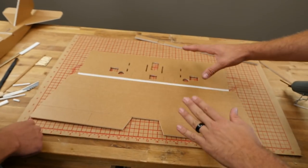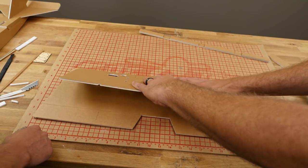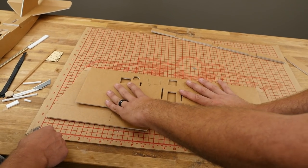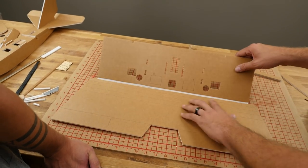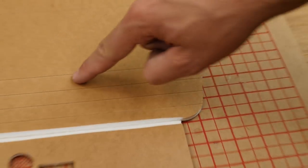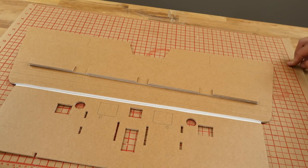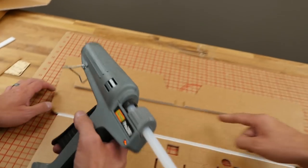Before we put our spar in, we want to establish a nice general angle. Very carefully press this top plate and slowly rock it down. Not just one clean bend — rocking it real slowly. We just want to make sure this leading edge knows exactly where it needs to bend before we put stress on these areas. Now we're ready to move our spar. We want to keep this wing as thin as possible. You're going to notice two etch marks here and one over here — this is the area that our spar is going to be glued down to.